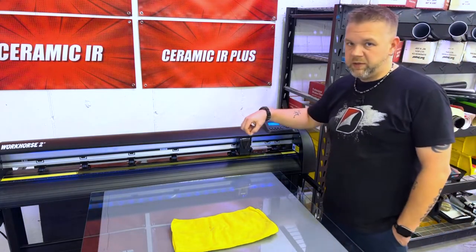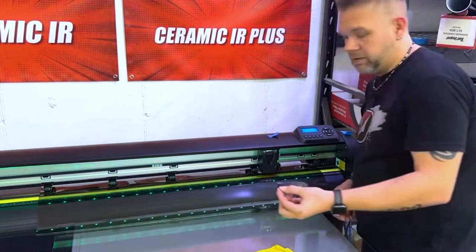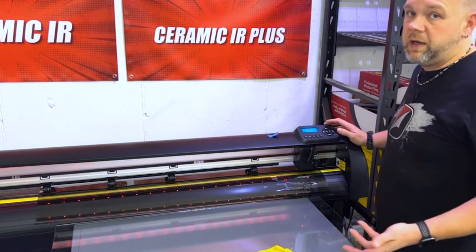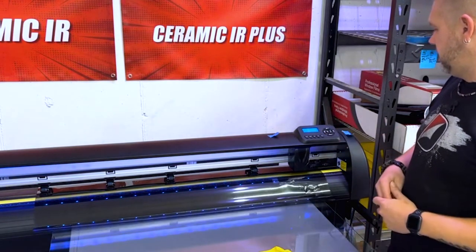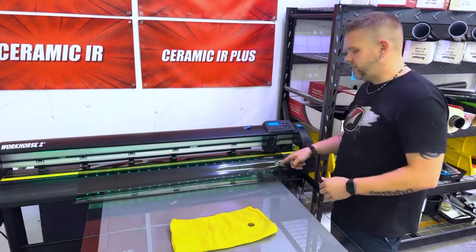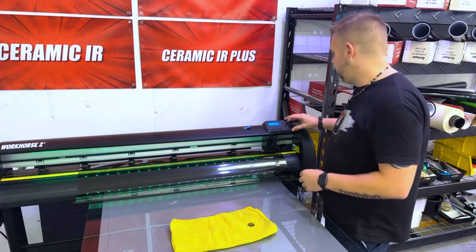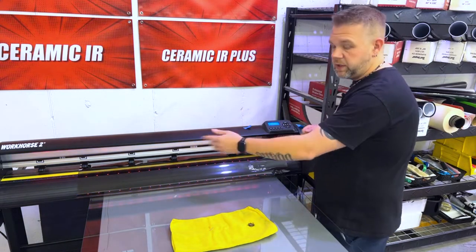See how it grabbed? It kind of pierces through the film, so watch the height of your blade. We'll roll that out, take a look at it, see if we can peel it. We were able to actually peel that, and we're at 66. You notice I have tape on my cut strip — it's actually outside painter's tape, and then it's a piece of Gorilla tape over top of it. Let's hit test again. It's still piercing the film, and I don't like that. It's still peelable, but it's grabbing the film — it's not a smooth cut. You can actually hear it dragging on the film, so that is an indication right off the bat that it's not a very good blade. So I'm going to reset this and show you another option to test the difference between your cutting strip and the blade.